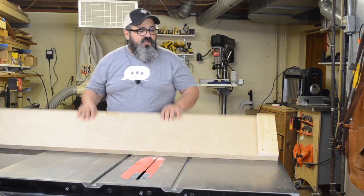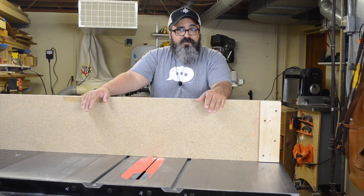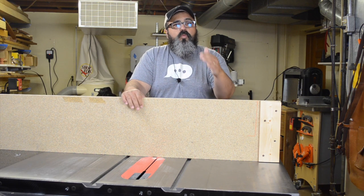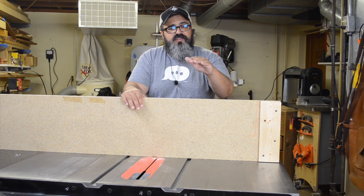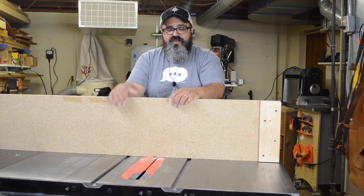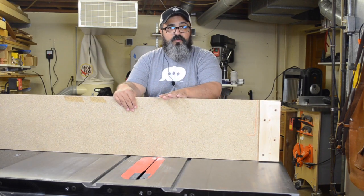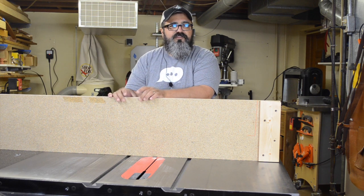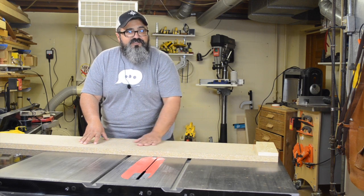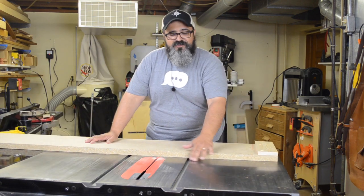A lot of people were concerned about the rigidity of this particular board, especially given the length that we have on it. If you feel like it needs to be more rigid, you could actually beef this up. You have to go to your thickness planer and think about what's the maximum height you can actually use — how high can it be before you simply can't run it through on that first face? If you're concerned about the rigidity along the length, you could easily beef this up by adding either a second one of these — which is going to make it really heavy — or just adding another half inch or three-quarter inch material for extra rigidity. To attach them, I would probably just screw right through it since the surface won't be hit by the planer blade. Just make sure the screws are not sticking out the bottom, because that would really mess up the surface of your thickness planer.